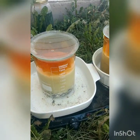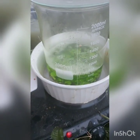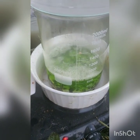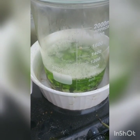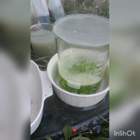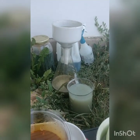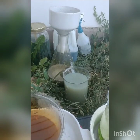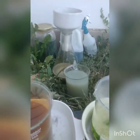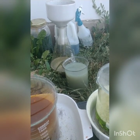I'll let these cook for a while and be back. After leaching the ceramics in poor man's nitric for a total of two runs, I've created a poor man's AR using hydrochloric acid and potassium nitrate — I ran out of sodium nitrate and had to use the next best substitute. The nitric leach is filtering now. We're going to test to see if there's silver in it, which I imagine there is, so I'll take a little bit and test it with hydrochloric acid. If it goes cloudy, I'll get that beaker warm again.